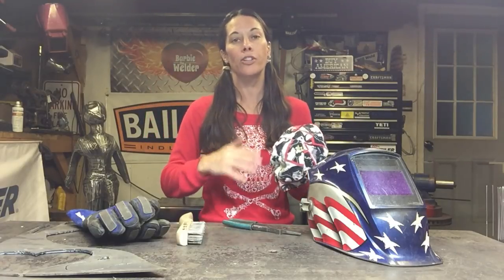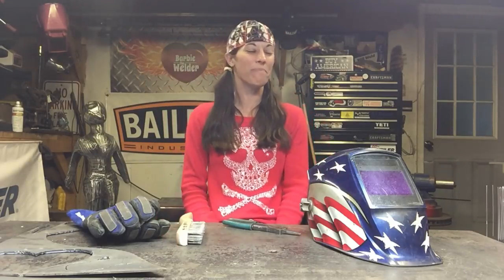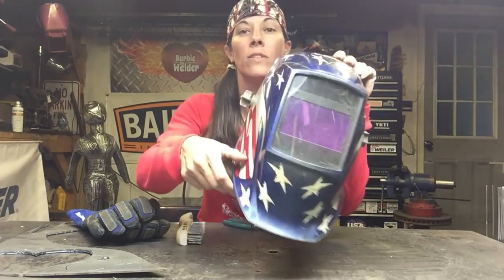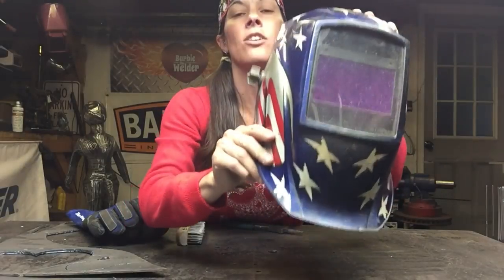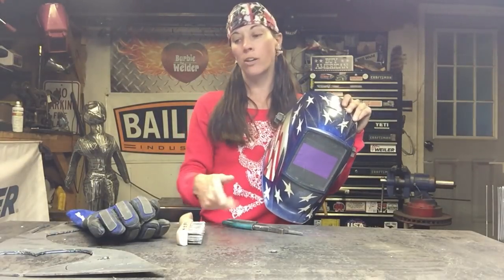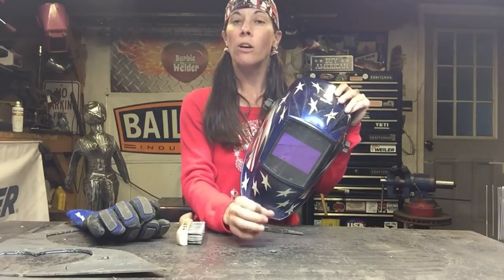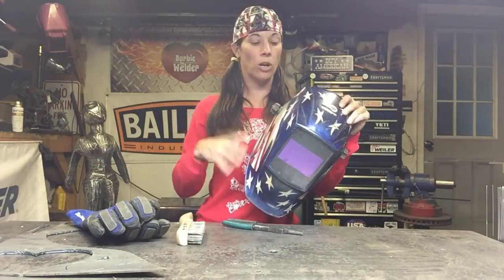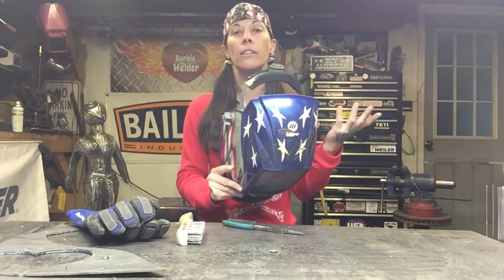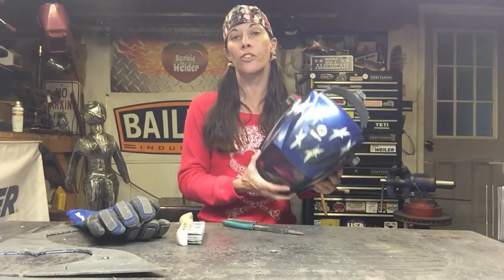I love my welding caps — I love my hair. MIGs throw sparks, so you want to protect yourself and make sure you're covering everywhere. I have this cool little welding cap from my girl Lulu at Doug's Welding Caps — I got a Wonder Woman one because she rocks. And I have this quick-change helmet. You can see it's got sensors on the top and bottom. It's auto-darkening, so you can flip your helmet down and still see your work piece, but as soon as you strike an arc and pull that trigger, it's going to automatically shut down so that all you see is just the weld puddle. It's going to protect your face, your neck, and especially your eyes from those harmful rays. You can lose your vision from not being protected.